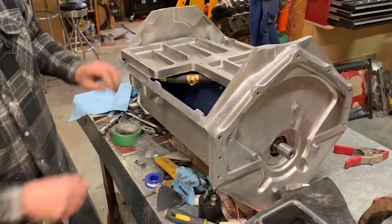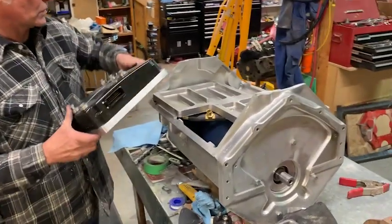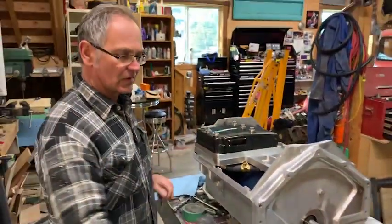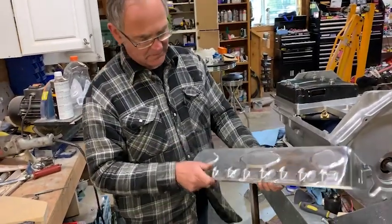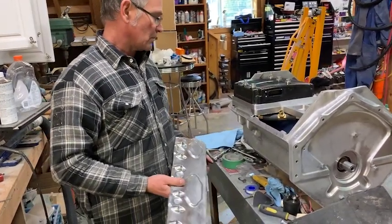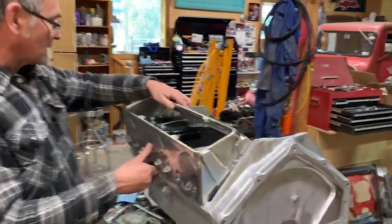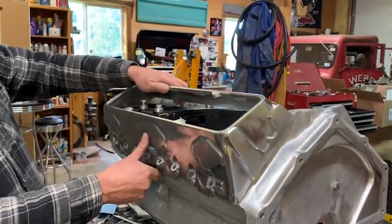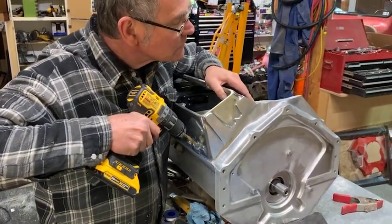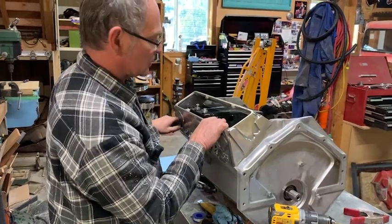This is where the controller's fitting. These water lines will come in and cool it. I have two controllers, so this is the one controller here — it's going to fit like that. Then the next piece is the head, which I've got here. It's a hollow head. Did a little buffing on it — I thought it'd make it look nice and shiny rather than paint it. My concern was, is this all going to fit together? It actually does. This head goes on here like this. I'll just drill and tap that, and assemble this, and carry on with a few other things.